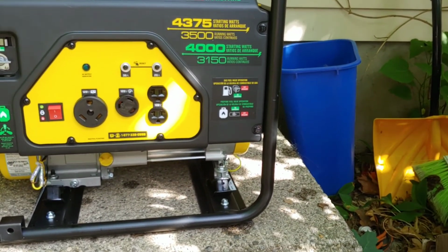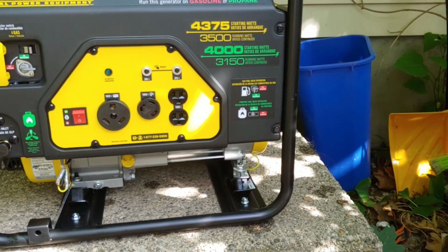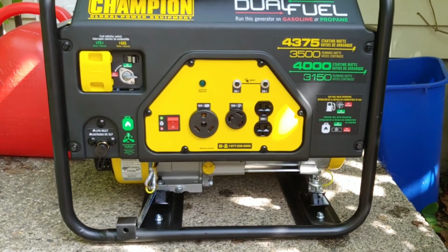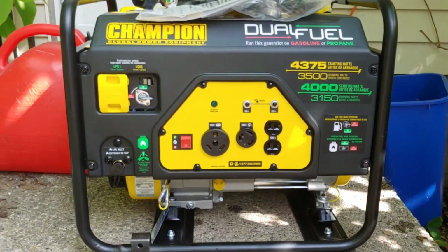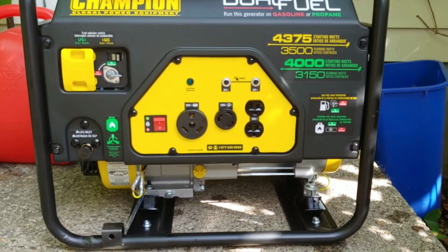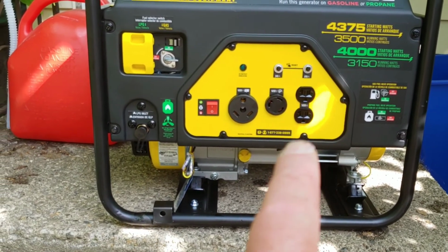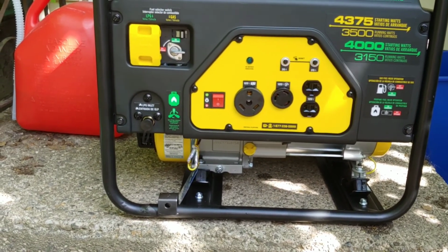Wherever you're going to run it, if you're going to run it in an RV, connect it to the RV ground. When there's a generator in your RV, it also is a floating ground. That's one thing I never did like about having a generator not grounded: it uses the chassis of the vehicle, but it's not earth grounded. The tires are your insulator. But if you're going to run this in your house, I'd highly recommend it, because if you notice, this 120 outlet's not a GFI, so that could be a problem. It's misleading with that ground right there. That's not ground. It's referencing it to itself.